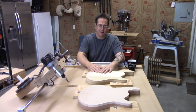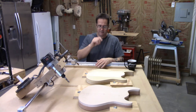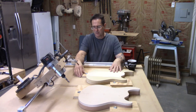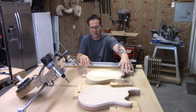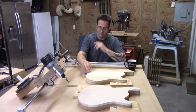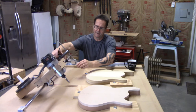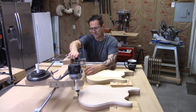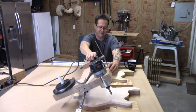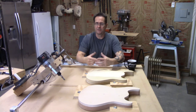What I have in the machine right now is a double cut carve top, and I'm going to show you how this is done. Some things to note: everything has a center line — the center line for that body and the center line for this body. These clamps here are the same on both sides. My single cut and double cut bodies are the same in this area and down here. These clamps kind of hug the body; I line everything up on the center line, tighten it down, then take my stylus and bit and run them in different spots — like the back of the body — to make sure they're accurate, checking the inside cuts, and then lock down the other side.